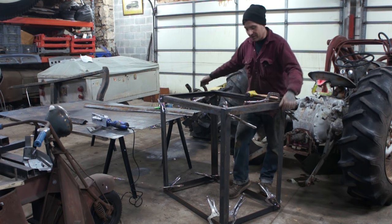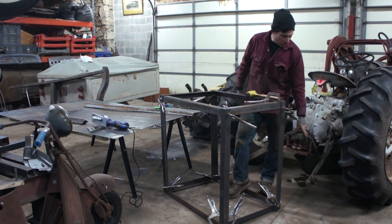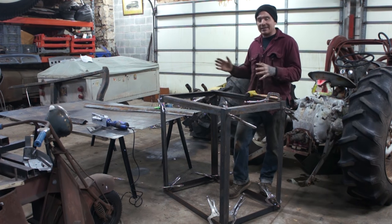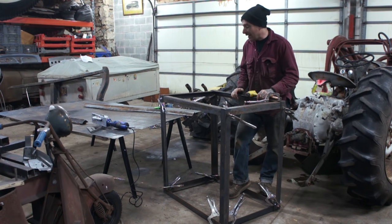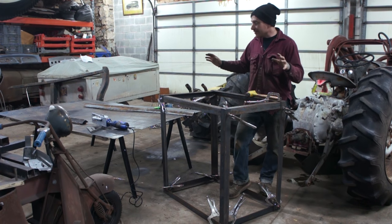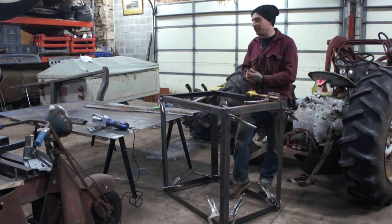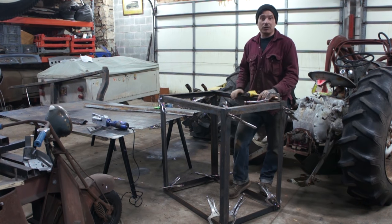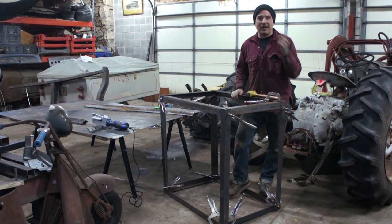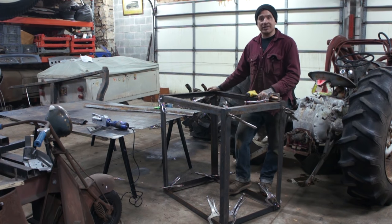and then we should be good to start moving on to the next step to make some of the bracing around the outside perimeter of it, and then where we're going to actually be hooking the pins to. They're going to actually hook to these back bars here to actually lift it up, but I am going to try and get everything kind of tacked together before I really weld it all up and lock it in, but I need to kind of twist and tweak this thing to get it all to sit just right so everything's pretty square, and that's going to take just a little bit of old-fashioned elbow grease as we go around and tack everything, but I'm going to use the MIG 175 on this to weld it all up. Not doing anything real crazy here, it's just some tractor repair, so it's kind of nice to just quick hit everything with the grinder and just crank the MIG welder up and just burn some steel. So I'm gonna get this all tacked together here, and we can move on to the next step.